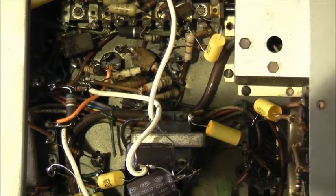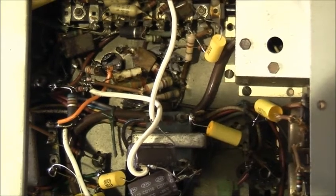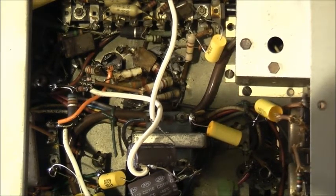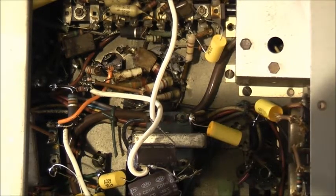That's better. Okay, look at it. Yeah, pin 8's there. 100k resistor there, 100 picofarad there, and it's going to the CRT there. So that may be it actually. Pin 8 may be where it goes to. It looks like it, where that yellow wire connects to. So it looks like that's the part in question.